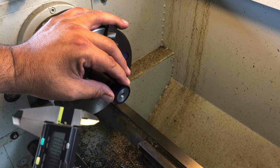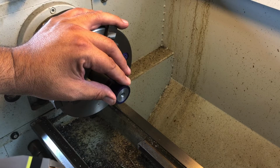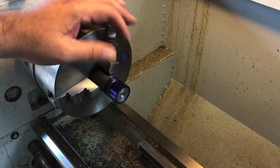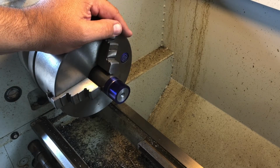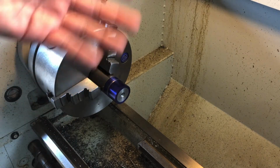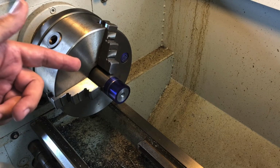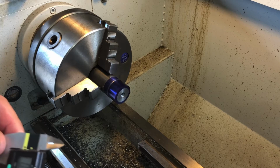That's the major for a Remington rifle barrel tenon. When you're turning a rifle barrel to fit into a receiver, you usually undersize that by about 5 thousandths. But for this project, on your print, the major is 1 inch 50 thousandths, so that's what we're going to turn this down to. You turn it down undersized like that because each receiver is a little different, varying by 1, 2, 3 thousandths from receiver to receiver. So you turn this part down to 1 inch 50 thousandths so that it can fit in all receivers and be able to lap out the lugs on your bolt.